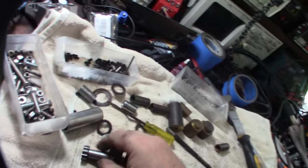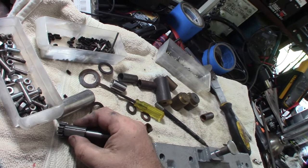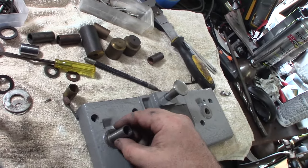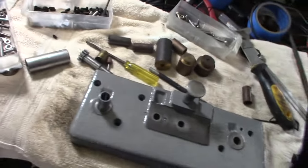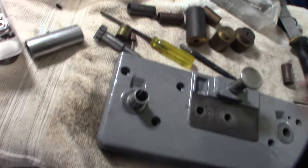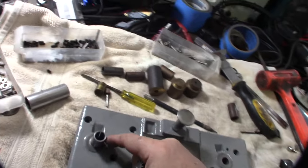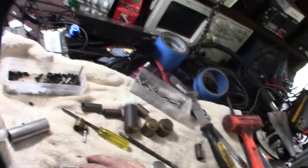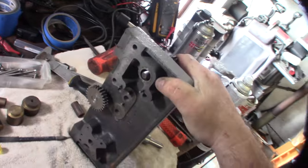I'm not sure if it's hardened steel or not, but it's probably going to be harder than this material. I'm probably going to sand it down slowly until I get to the point where it's right. I want this to be such a tight fit — I want it to be perfect. I'm just tapping this in a little bit, and I can see the crush, and I can see the gap opens up the more I do the outside. Just going slowly with emery cloth, sanding it down until it's going to be perfect.